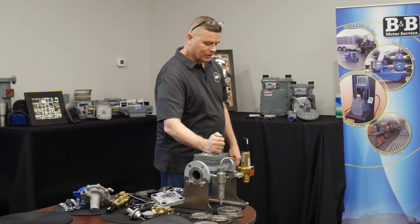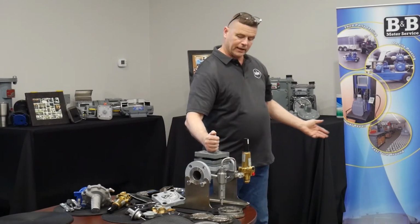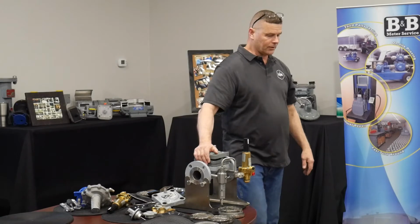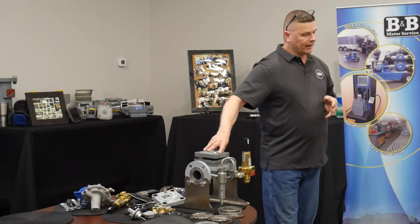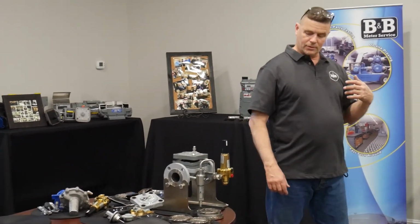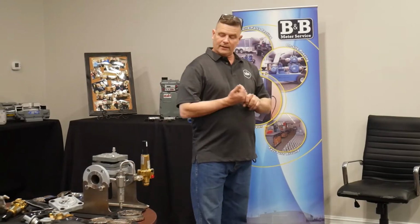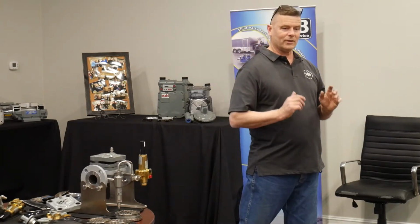So what we're asking the customers to do is to plan for changing this to the large port so you can continue to get the soft goods and keep the regulator functioning in perfect health. What's one consideration that the customers also have to decide? If you look at the FG3 and the FG29 on those charts, and let's say they both had 100% throttle plates, the conversion kit we give them to large port has a 100% plate because the original regulator had a 100% plate. What happens to the CG? First of all, let me describe what the CG is.